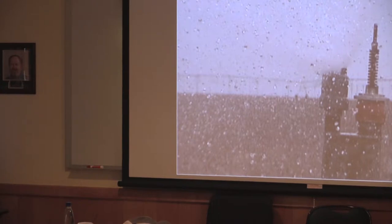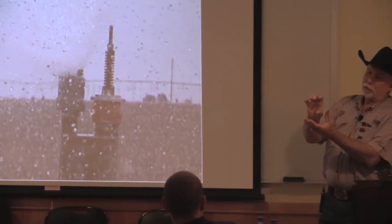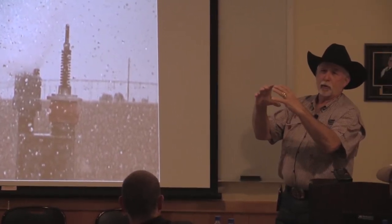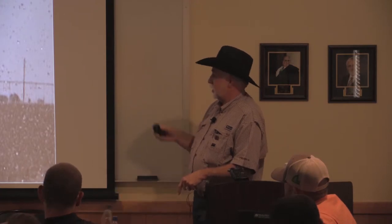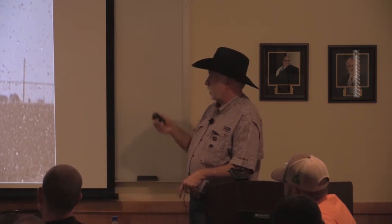The ball in that air relief, when the valve would change, the pressure would drop, the ball would start to fall, and then the water would get back up on top of it. It would just suspend that ball with pressure on it all the way around it, and it wasn't seating. You could go up there and tap it and solve the problem, but you had to go tap it to make it stop. After you made a lake, first time it did that for a while, you go, something's wrong. Well, yeah. Change the air relief, the continuous acting one, and fix the problem.